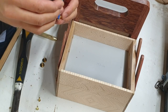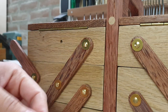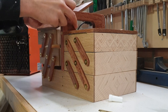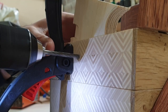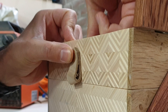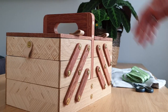To make sure the links didn't wiggle loose over time, I used Loctite on the screws so they stayed fastened even after opening and closing the box multiple times. I had to drill into the plywood pattern to attach the straps to the side, but looking at the final result, the leather is a nice contrast with the wood and it's an easy way to open the boxes.